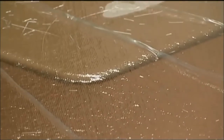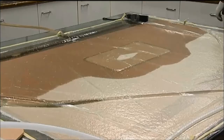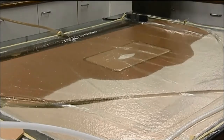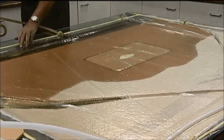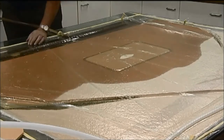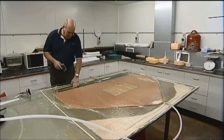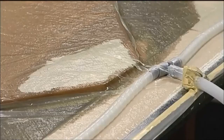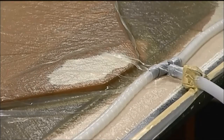One of the advantages of the resin infusion process is the accurate placement of all reinforcing and core material. It is an enclosed system, so no escape of volatiles to atmosphere is encountered. A high reinforcement-to-resin ratio is achievable with reduced labour input. However, it needs resins with longer gel time, and there is a risk of air voids if the resin path is not correct, which may result in scrapping the total part.